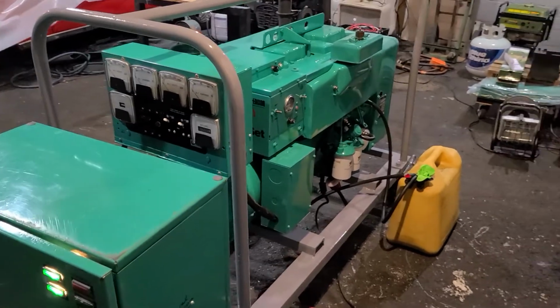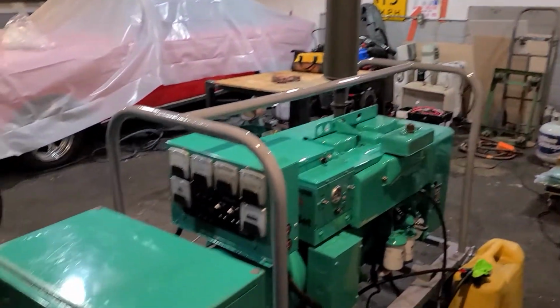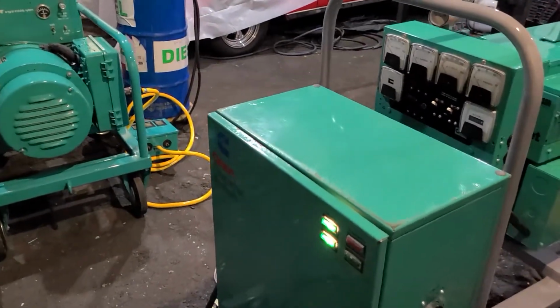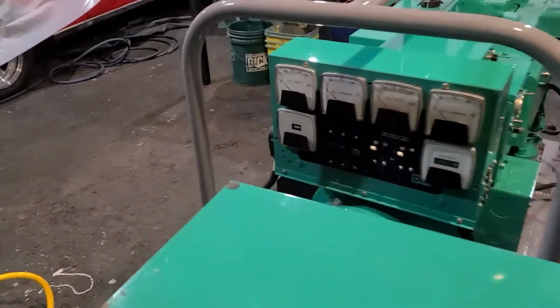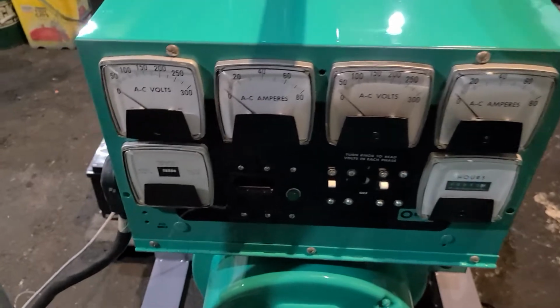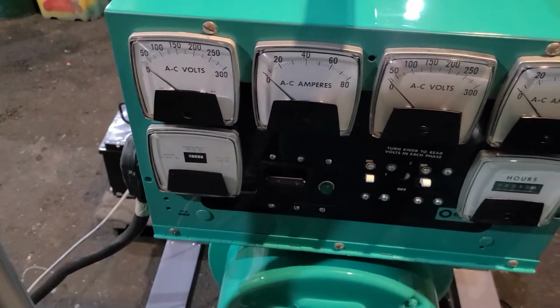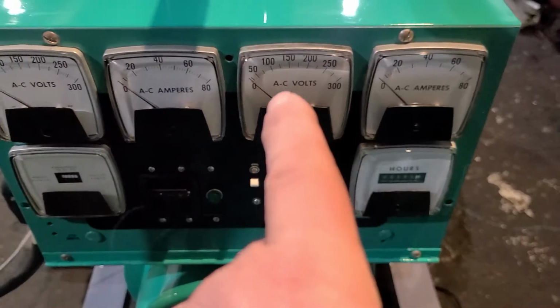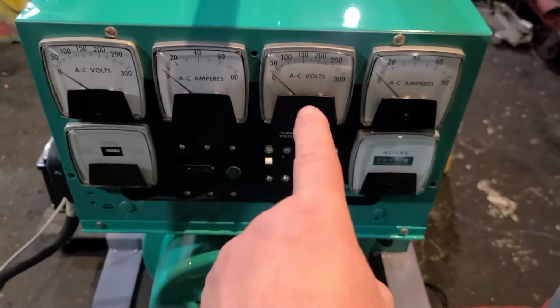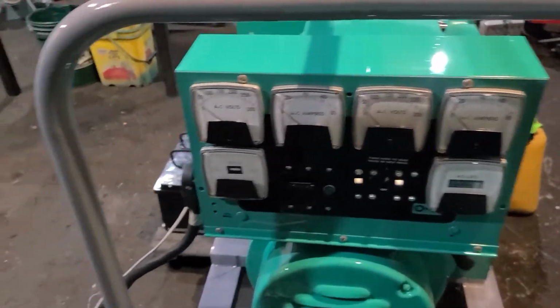That's activating the glow plug, sort of like a warning, like, you know, something's going to happen, and eventually we'll start things up, okay. Since I am not load testing, just basically seeing that these things kick on and produce some kind of voltage, you should see something happen here. It should go to about 120, 125. Likewise with that as well. Okay, hopefully it'll stay in focus. The amperage will stay down at 0 because again we don't have a load going.